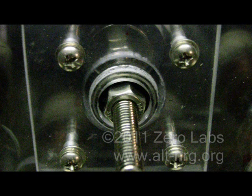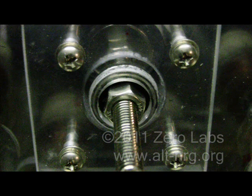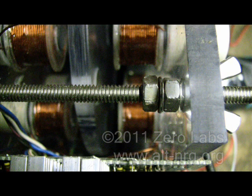There was a little bit of a rattle in my bearings that I wanted to quiet down, so I decided to close down the spacing a tiny bit between the motor end plates to preload the bearings. The threads that keep them spaced are 1/4 by 20 threads, and I turned the nuts inward approximately 1/3 of a turn, or 16 thousandths of an inch.